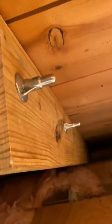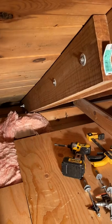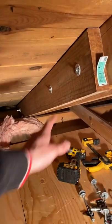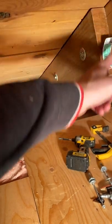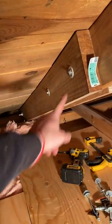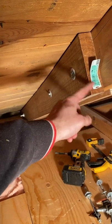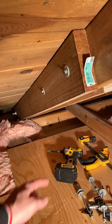As you can see in the back, you've got your other side here. It's kind of a pain in the ass — it took me about three hours. But to recap: identify the crack, measure it, get yourself two pieces of wood that are the same size as your rafters, and extend about 20 inches at minimum on either side of the crack.